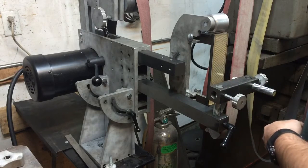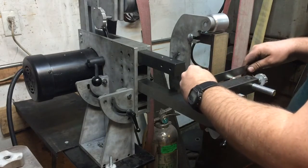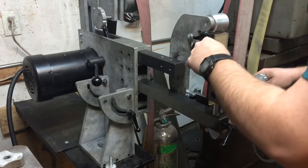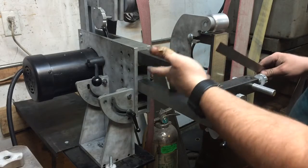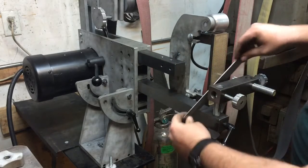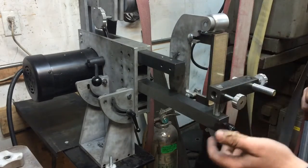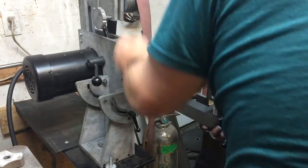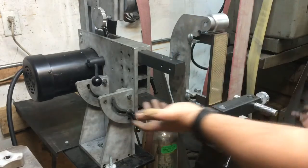But then you've got, well, let me use this razor. You've got something to sharpen on, or to pivot your blade, do that sharpening technique or grinding technique. And because it's raised there, you've got plenty of clearance on this side to do the same thing. And if you need even more clearance, just lower your tool arm like that.